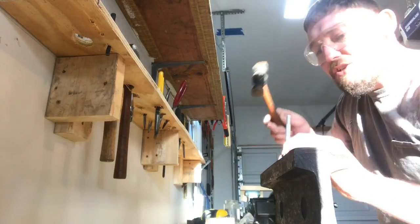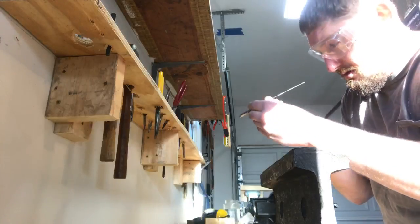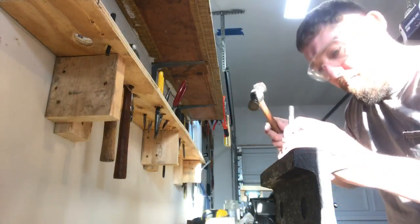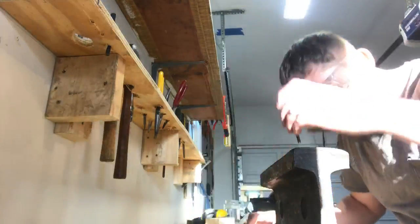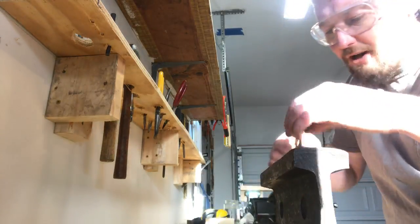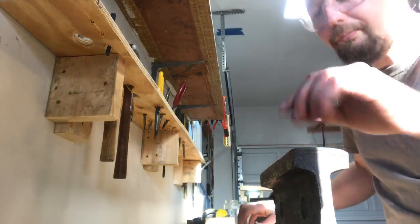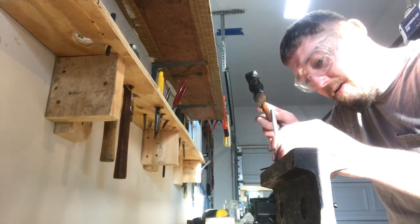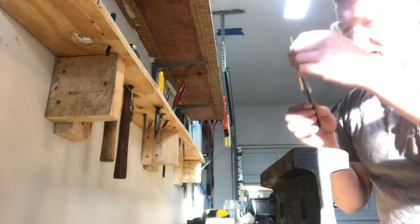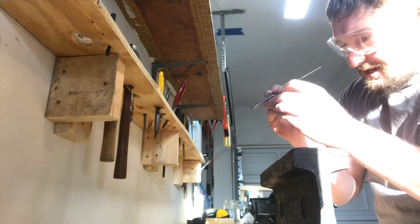And I know my channel is good, so I think it's just the frame itself deforming. Yeah, we're sitting almost good there. Good on front. I try to go a little bit at a time because anytime I beat on the frame, I know that I'm deforming it a little bit, and I don't want that. As I've been hammering it down, it straightened out a little bit. Kind of deforming evenly.